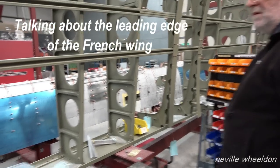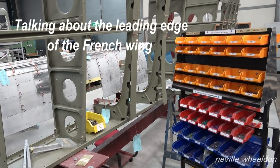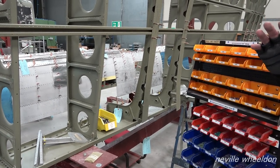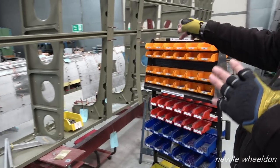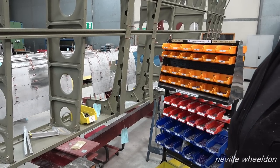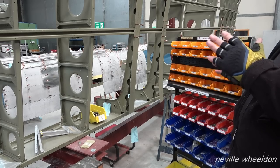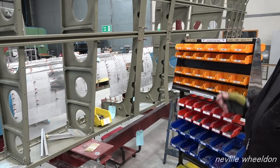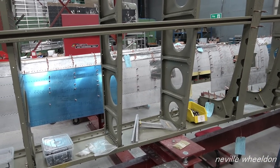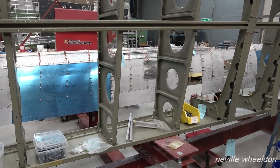And last week you were having trouble because you thought it was being compressed and pushed over. Oh, what, the skin? Yeah, it's because everything was that way. So I undid it all, then put that panel on, put some screws in it, and then did everything else up again. It's all coming in line. It was too much to try and move in one go with all the skin pins, it was holding it too tight. So I relaxed it all, put the screws in first, then pinned it up and pulled it over and it all lined up.